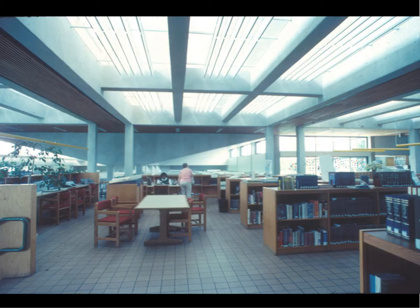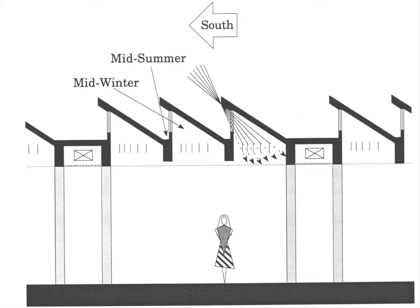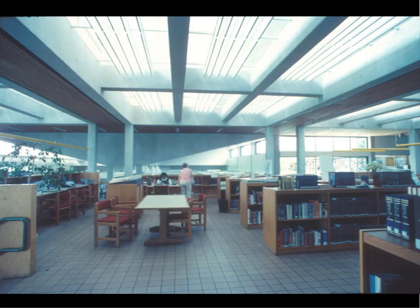This is a cross-section of the Mount Airy Library, and this is what the building actually looks like. There are several different daylighting sources — a strange dished-out roof with apertures, but most of the roof is the sawtooth structure shown here. Looking up at the baffles: in this case they're just thin sheet metal painted white, and rather than just dangling a sheet of metal they've turned it into a small I-beam to keep it from wafting around in air movement from the HVAC system.